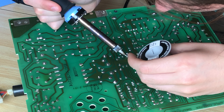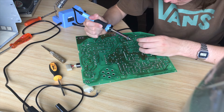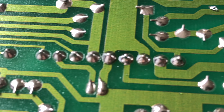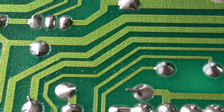I've seen a ton of YouTube videos on Macintosh 128Ks, 512Ks, and Macintosh Pluses that had cracked solder joints on the analog board causing this black screen problem. Now that looks better — I might have used a little too much solder on these joints but that's no reason for them not to work; it should be fine.